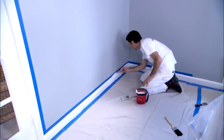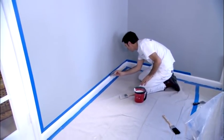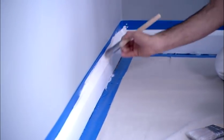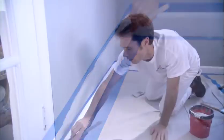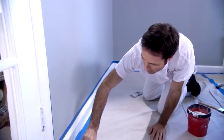The best place to start painting is in the corner, and then work your way around the room. Carefully paint in a nice straight line. Make sure your paint strokes follow the length of the baseboard rather than going up and down. Once you have completed the painting and the paint is set to touch, you should remove the painter's tape.